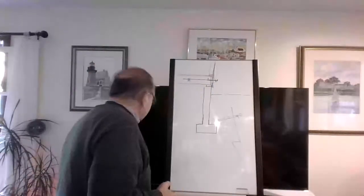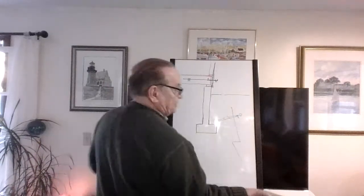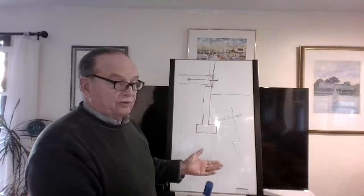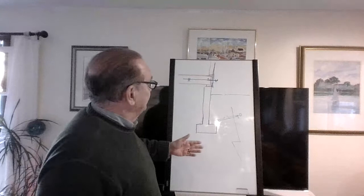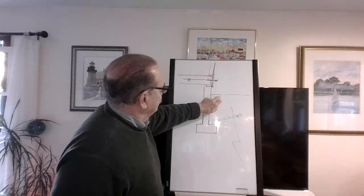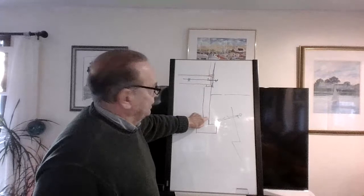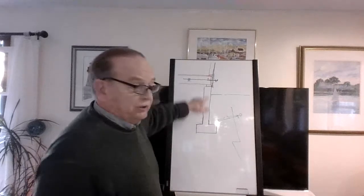Now, if you don't know what you're doing, here's the problem. If you reach in underneath here with your fingers, you can usually feel the top of the foundation, usually. Now, I've seen these shingles go all the way down like this. If you've got a garage that's cut into a hill, like a raised ranch, for example, and you walk out from the lower level, sometimes to hide all that concrete that's going to be showing, they'll bring this shingle down like this. So to hide all this concrete, they'll put furring, strap it right to here. They'll shoot it right into the wall, and then they'll put up like 1/2 inch plywood, and then they'll put shingles on it.